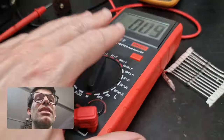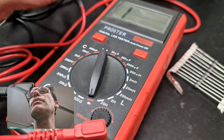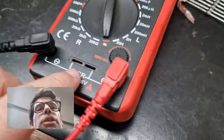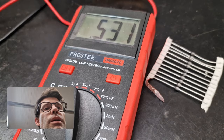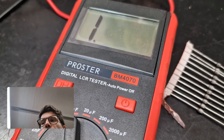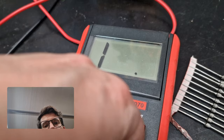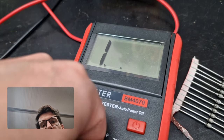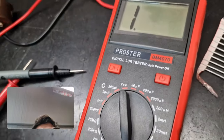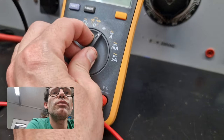These capacitor meters are actually very good — I bought two on Amazon and they're very nice. They also measure diodes. You see — 0.529V forward voltage and if you switch them it reads nothing, confirming the diode direction. That's inductance, that's impedance — for resistance yes. You can do quite a lot with this unit, just not voltage measurement. It's quite interesting.